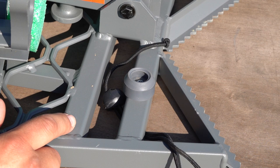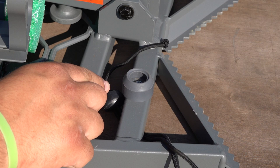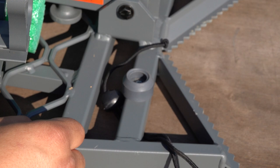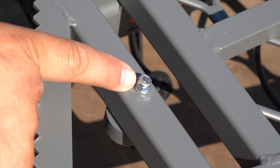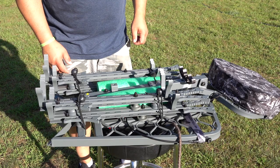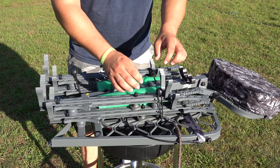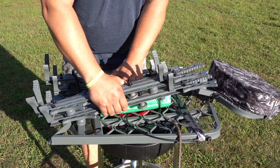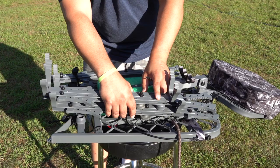Probably the most complicated part of this job is just finding a machine screw that's the right size. I ended up using a 10-32 machine screw I had laying around and then found the appropriate drill bit. When you drill your hole, you have to go straight down — you can't go on an angle or off to the side. It has to be straight down; a drill press would be your best bet. On the back side, I just put a nylock nut with a washer.